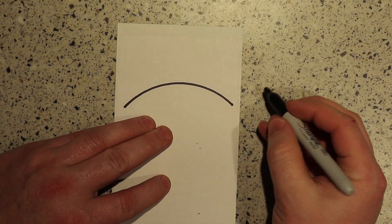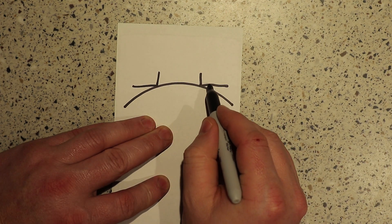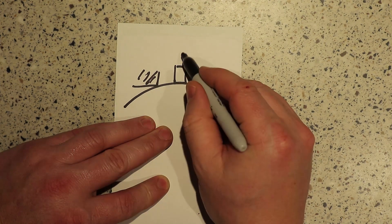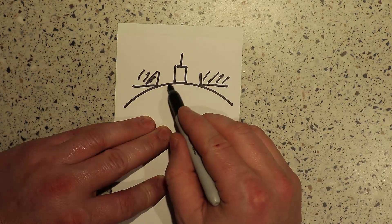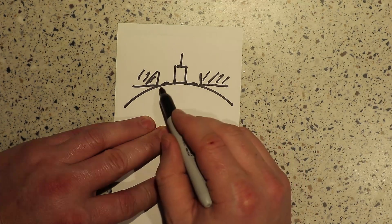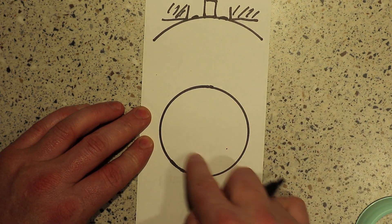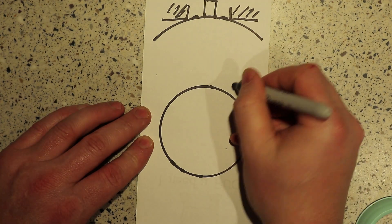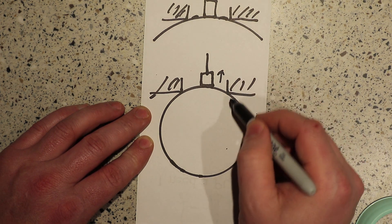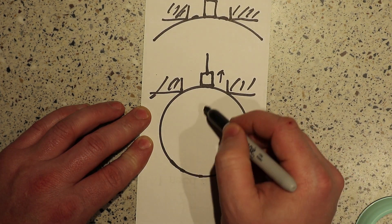The whole premise of what I'm talking about here is: say you want to cut a sphere — this is a 2D representation of the router base, and your router bit is there. Anything that's not a circle, say you have a little rise here or there, gets cut away by the router bit. This can be used to cut a sphere. If you wanted a smaller diameter, your router bit is retracted a little further up into the base. The further the router bit is retracted, the smaller the diameter circle or sphere you're going to make.